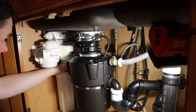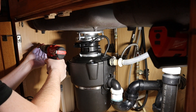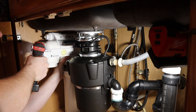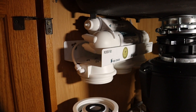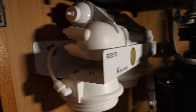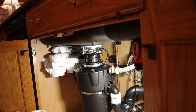This step's a little awkward because I don't have a ton of room next to this garbage disposal, but I'm using a pencil to mark on the holes where the screws are going to go. I pre-place the screws separately so I don't have to hold the water filter at the same time, and then when I go to put them back in place the screws go right in without fighting. When installing, just make sure you've got enough clearance — there should be plenty of room to pull this filter off and change it later, maintaining the serviceability of the system.